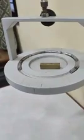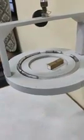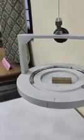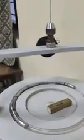So, before starting to take the reading, we need to make the torsional pendulum perfectly horizontal. So let us make this one perfectly horizontal. To make it perfectly horizontal, let us put this spirit level at the center of this table, actually at two perpendicular directions.